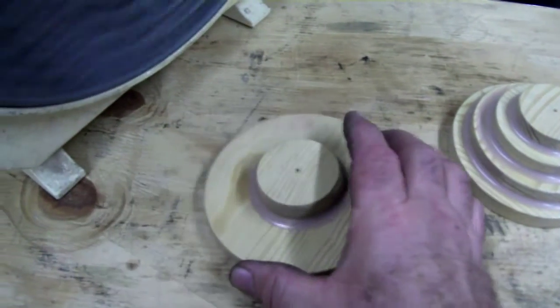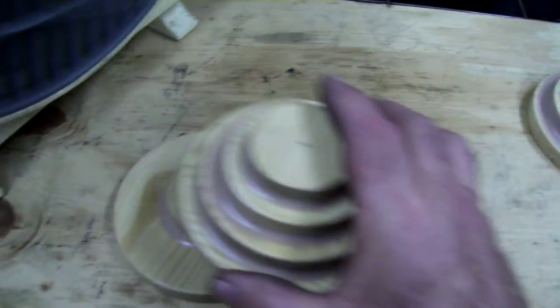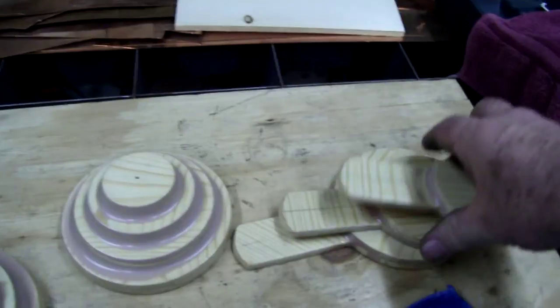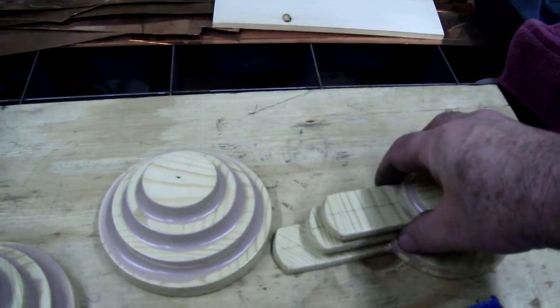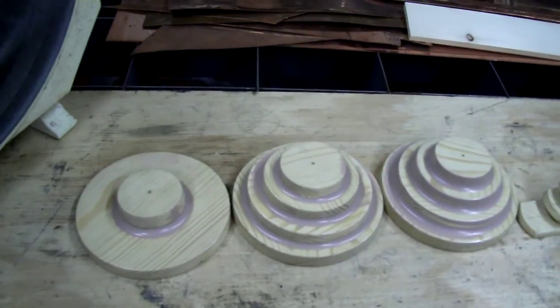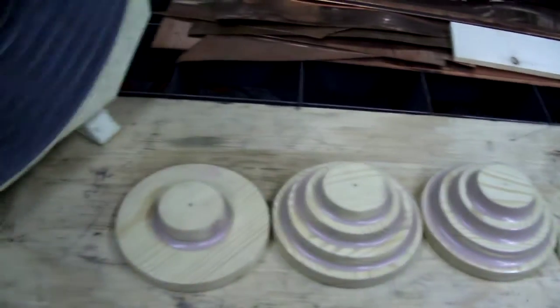Here are the parts I'm going to have to cast. This is going to be one gear, and this is going to be one of the pulleys or sheaves — it mounts onto that hole right there. Then the other one for the motor to drive it, and these are going to be the back gears. I'll need to build some brackets too. Once I get all the patterns made, I'll cast everything out of aluminum, or maybe some different metal that's a little stronger so it won't wear out as easily.